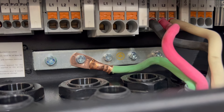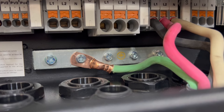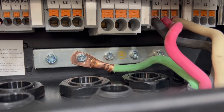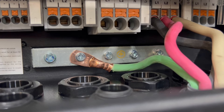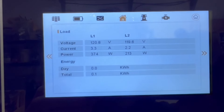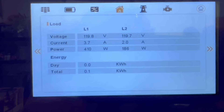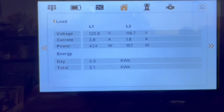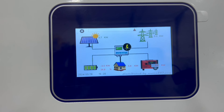The output is hooked up. This is 6-gauge wire — it is not easy to get into the outputs, and that is why they call for 8-gauge. But 6-gauge you can get in — I use ferrules on it. This is fine-stranded wire. I'm going to be running this cable to my subpanel to test a bunch of typical house loads. The house is on the inverter. You can see one leg is pulling 420, 470 watts, and the other is 178 watts. I've already got 3,000-something watts on the unit right now, and I'm going to see if we can overload it.